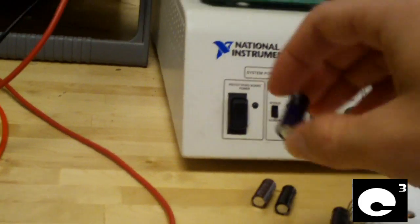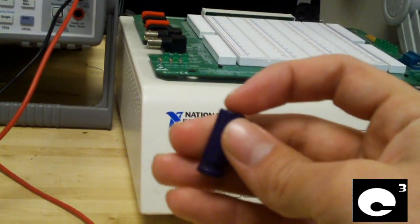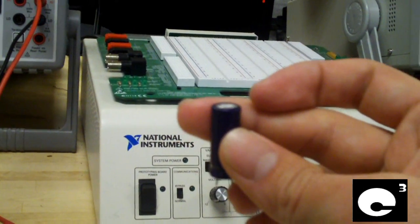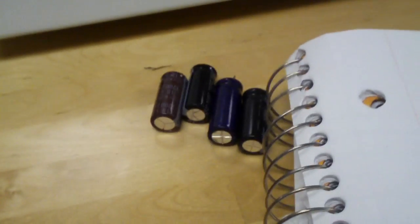The thing about electrolyte capacitors is that over time they can lose their capacity. A lot of electrolyte capacitors have the tendency to fail, especially if they're a bad series or have a flawed electrolyte formula inside them. All these caps here are actually not failing, but one of them is a known bad series — that is a Nichicon HM.